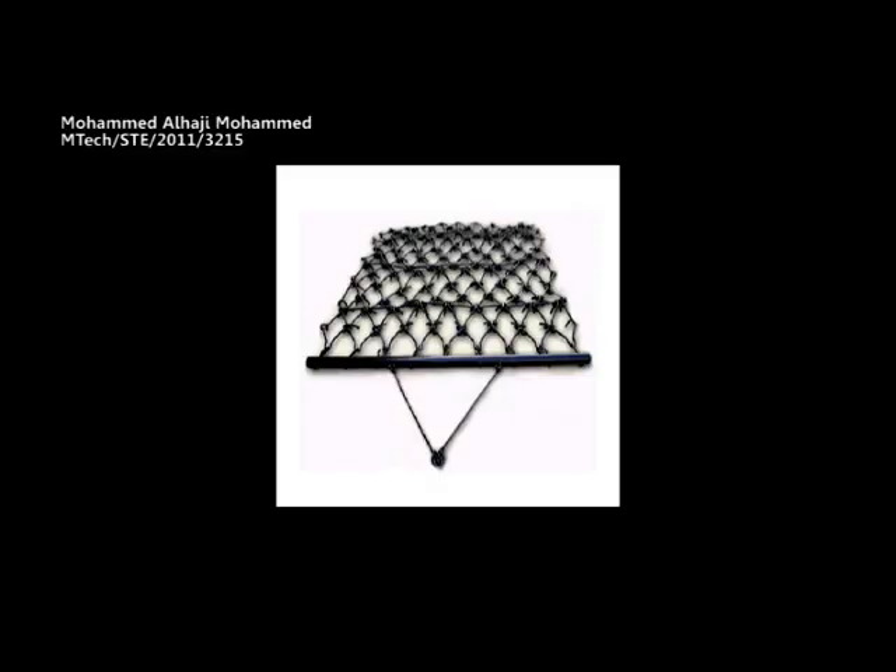Type 2: Drag harrow. A drag harrow is a type of spring-tooth harrow. It is a largely outdated type of soil cultivation implement that is used to smooth the ground as well as loosen it after it has been plowed and packed. It uses many flexible iron tines usually arranged into three rows. It has no hydraulic functionality and has to be raised or adjusted with one or multiple manual levers. It is a largely outdated piece of farm equipment, having been replaced by more modern disc harrows and deeper stiff-toothed rippers.